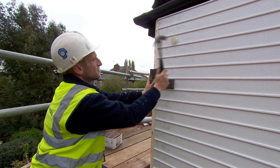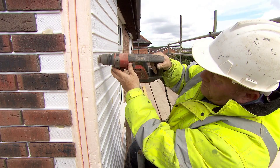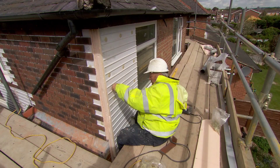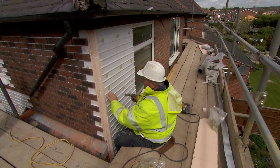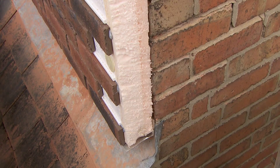It's important to fix only as much panel to the elevation that can be bricked in a day. Put in the rest of the fasteners except the lowest two runs. There should be four across the width of the panel and one in every fourth course vertically. It's vital that the correct number of fasteners are put in. These should be tight enough to pull the washer flush with the board, but not so tight that they distort the rib.